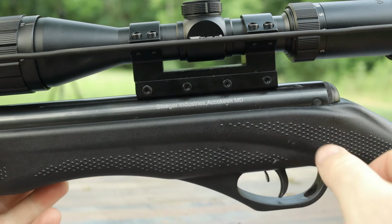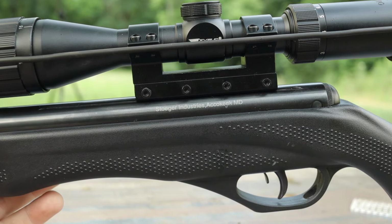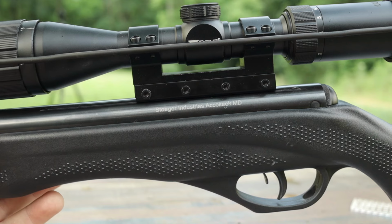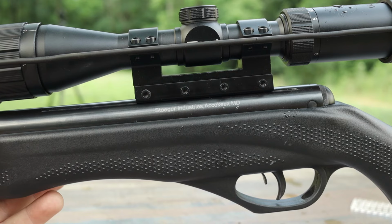And then inside of the air gun, I can't show you that stuff, but I'm using a Vortex spring, a Vortex seal, I'm using the Stoeger piston because it's a little heavier than a Crossman piston. And then I'm using a custom cut top hat that one of my buddies made for me that's just a little bit heavier than the Crossman piece.